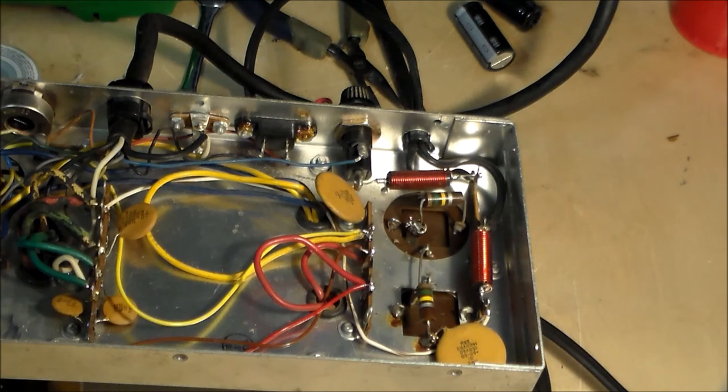This was my effort to retrofit the Drake AC4 power supply with this kit from, what was it, Sunrise? Whatever, the name of the manufacturer of the kit will be in the description of the video. So hope you got something out of it, or at least had a chuckle out of my foibles here, but there it is. It's working, and as soon as I get the covers on and get this connector epoxied up, we'll take it to the next step, which is adjust the bias voltage on the transmitter itself.